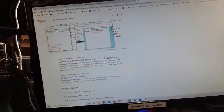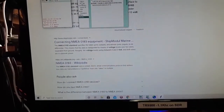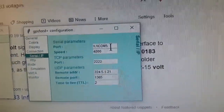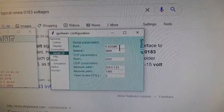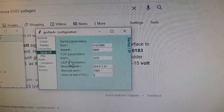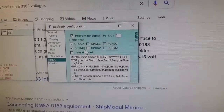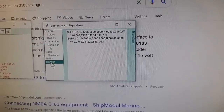If I just stop it for a second, no doubt the radio will have a paddy because there's no feed going in. On the connection settings, select Serial IP and put in the correct COM port path — the important bit is to use the format slash-slash-dot-slash-slash COM5, because just entering COM5 like normal on a Prolific adapter wouldn't work; there were no voltages coming across at all. Set the baud rate to 4800, and make sure the correct NMEA standards are selected — in my case GPRMC, and also GPGGA.